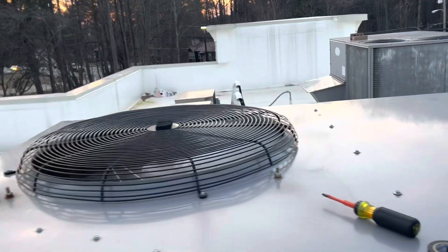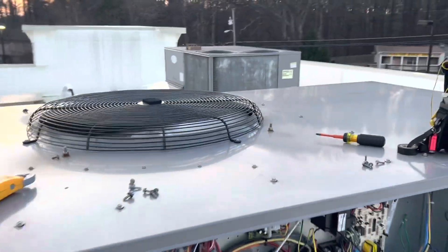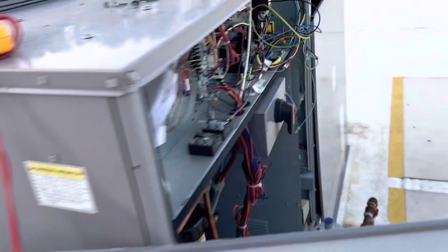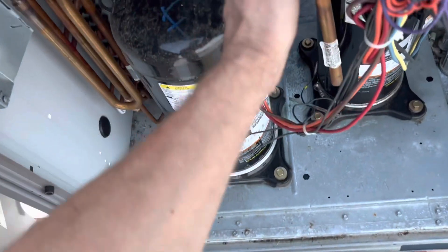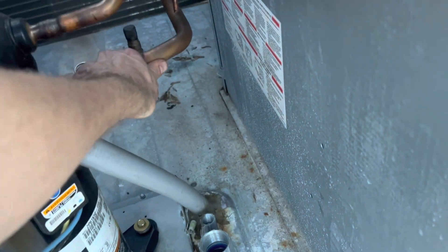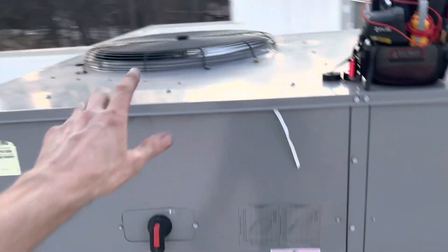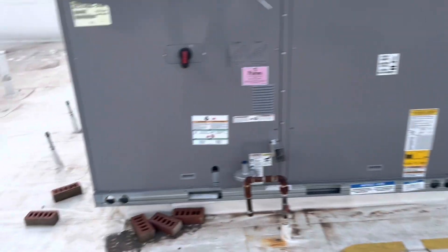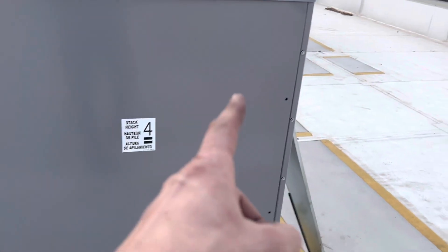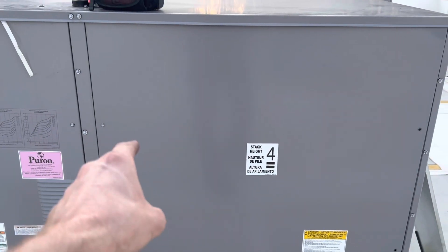This will cause problems in the winter and I'll have to address this in a different capacity. But for now, this is the kitchen and these units have no redundancy — that's the dining room. This hasn't been cooling all day and it's 77 degrees down there. This is new construction, only about a year old — they opened last December. The motor master junked out and I've already bypassed the variable speed drive for the blower too.